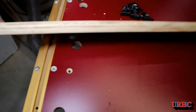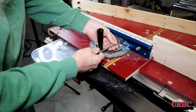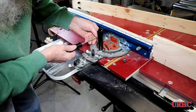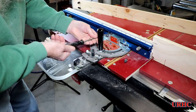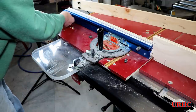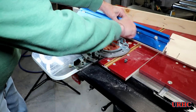I've already made a plywood sacrificial piece to put on it. I did stick a T-track in there and a couple of T-nuts so it just slides on the new fence. You can see the Kreg fence actually drops right in place on here — the slots in the Incra miter gauge are big enough to accept it and it just pops right off.